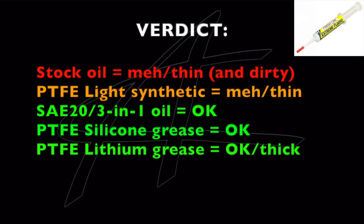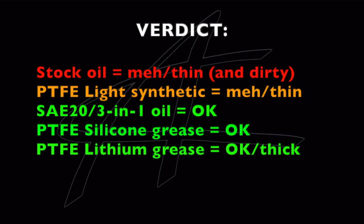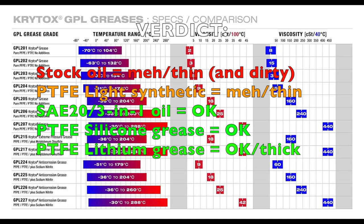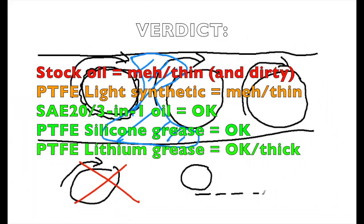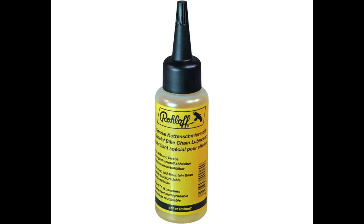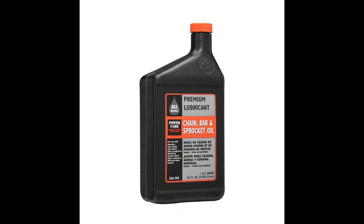Then there's the option of PTFE — a lighter lithium grease, pure white Teflon grease, that sort of thing. The stuff I like isn't available anymore, but there is something some people have recommended, or you can go with fancier lubes directly from DuPont. Just make sure you go with one well-formulated for this and use the lightest one possible to ensure your bearings circulate. Because as we covered in the last video, these are not bearings in a race — these are free bearings. If you get too heavy a grease, the viscosity will keep them from spinning, and they'll jam up — especially with the looser tolerances on these cheap rails where they're not making absolute contact with both surfaces all the time. Spray lithium grease is a bit lighter than even the super lube and the heavy oils, machine oils, bar and chain oil — which should probably work fine too.